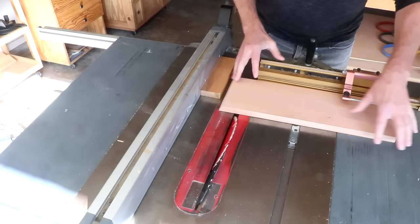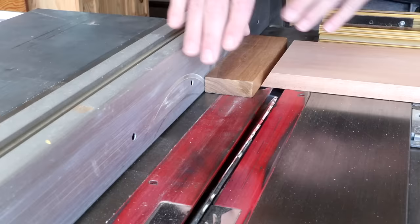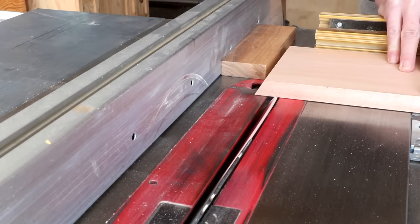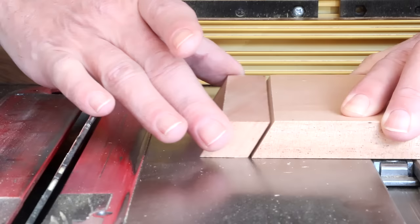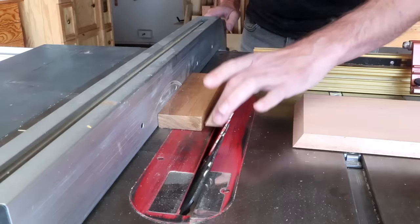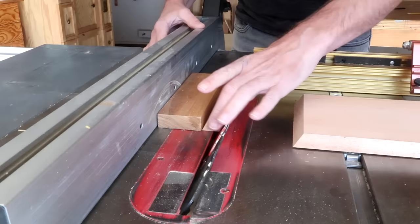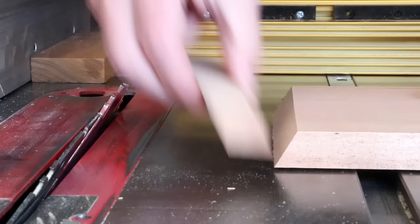So first thing I want to do is just run a test here. Looks about right. With this block of wood down here on this side of the blade, I'll just press my work piece up against that and feed it through the saw. To test this out, I want to flip this around so the end grain is up, then flip it around this way and see how close I got. It's a little bit smaller, so I just need to make this cutoff piece slightly wider — I'll just tap my fence over slightly. That looks like a pretty good fit.